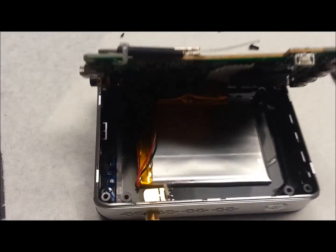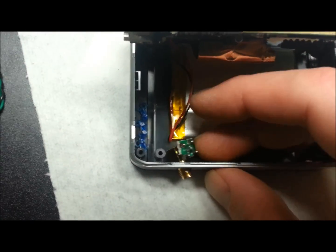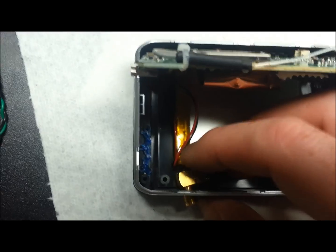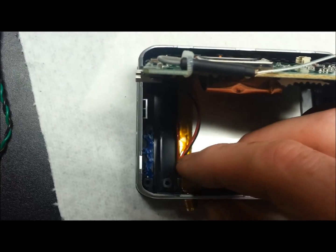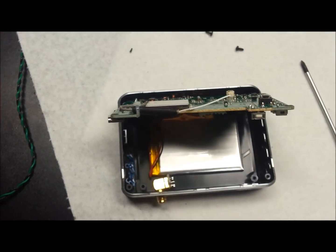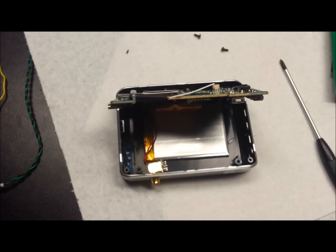Here's the inside of the unit — there's the battery pack. And here's the antenna jack that I'm going to be putting in. I left the chunk of circuit board on it, actually — it's going to make it easier to mount. I'll punch it through, drill the hole — it fits underneath the circuit board. All I have to do now is solder up some wires and hook it up.